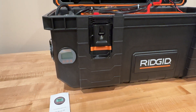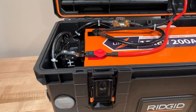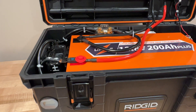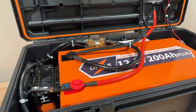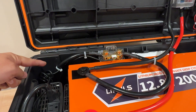The battery monitor is hooked up to a shunt inside of the box. That battery monitor is hooked to the inverter — it is going to read the load being pulled from the inverter through this shunt. It's very easy to hook up: you're going to take your load source, which in my case is the inverter, and take the negative cable.